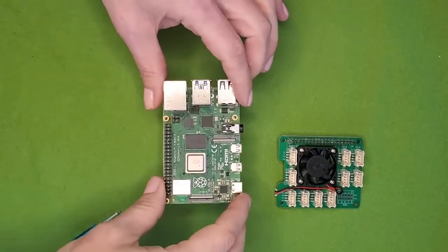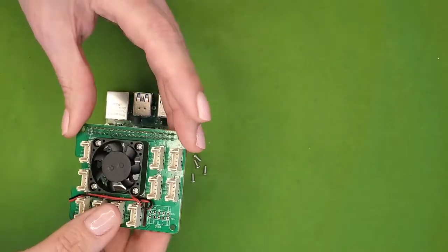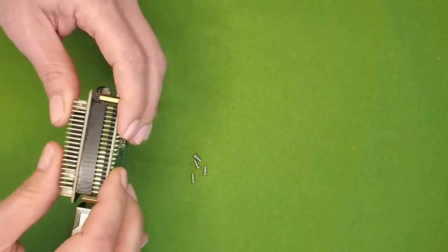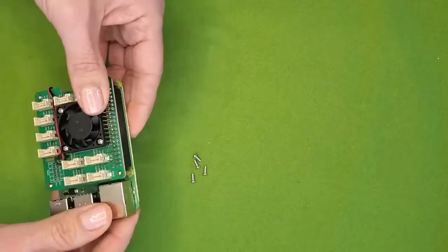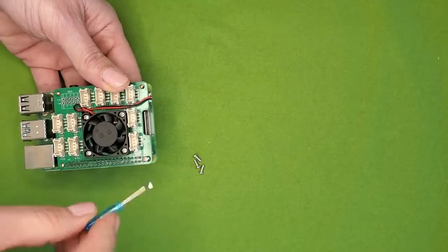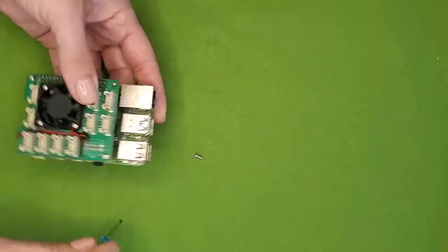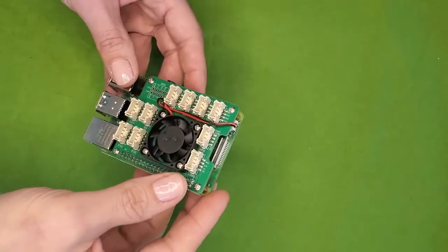Your Raspberry Pi should now look like this. It's ready to attach the Grove base hat. We'll be putting screws in the corners of the Pi hat to lock into these standoffs. Next, carefully align the pins on the Raspberry Pi with the socket on the Grove base hat and press it firmly together. Slide the pins and make sure they connect snugly — they should slide all the way to the bottom. Now take one of the screws, insert it through the top of the Pi and into the standoff, and use your screwdriver to tighten it. Repeat for the other three screws. Congratulations! Your Grove base hat is now firmly attached to the Raspberry Pi and ready to start attaching sensors.